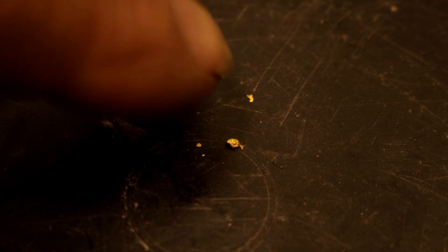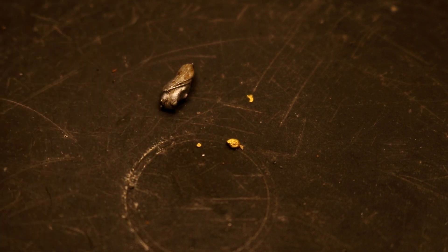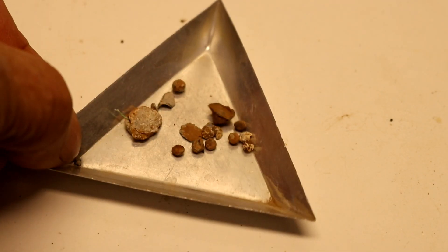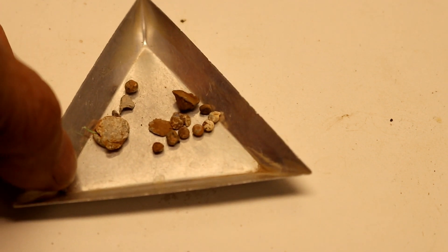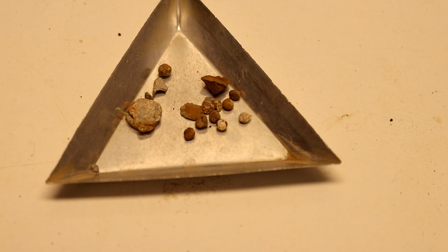What I'm going to do is pull the lead out, take a look at it, and if there's any gold I can see I'll pick that out. The mercury and everything else I'm just going to dump in with the black sands and run that through the tumbler, because we're going to put mercury on it anyway to pick up all the fine gold. We have a few pieces of gold, and then this big chunk with the mercury all over it — no idea what it is. This lead will go in our lead jar and we'll add that to the year's total.